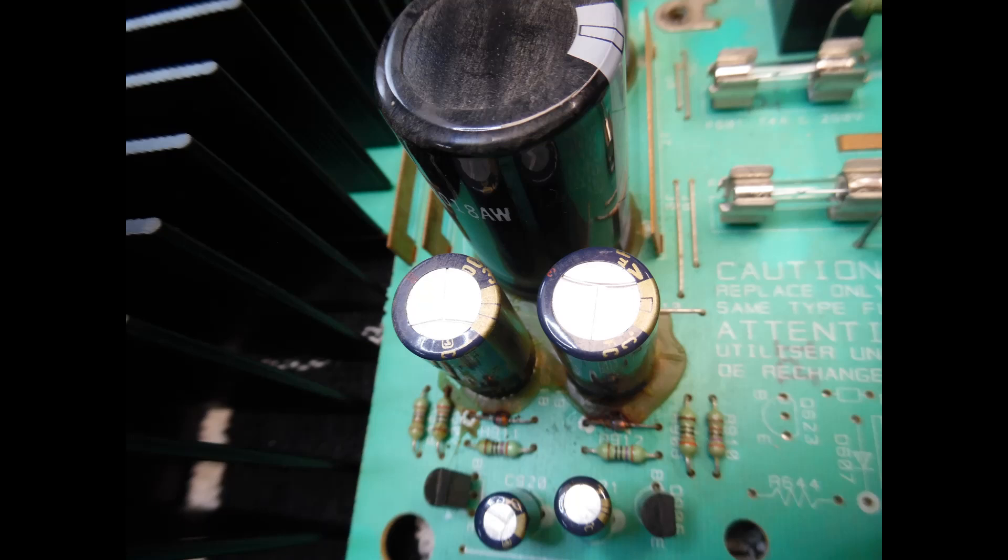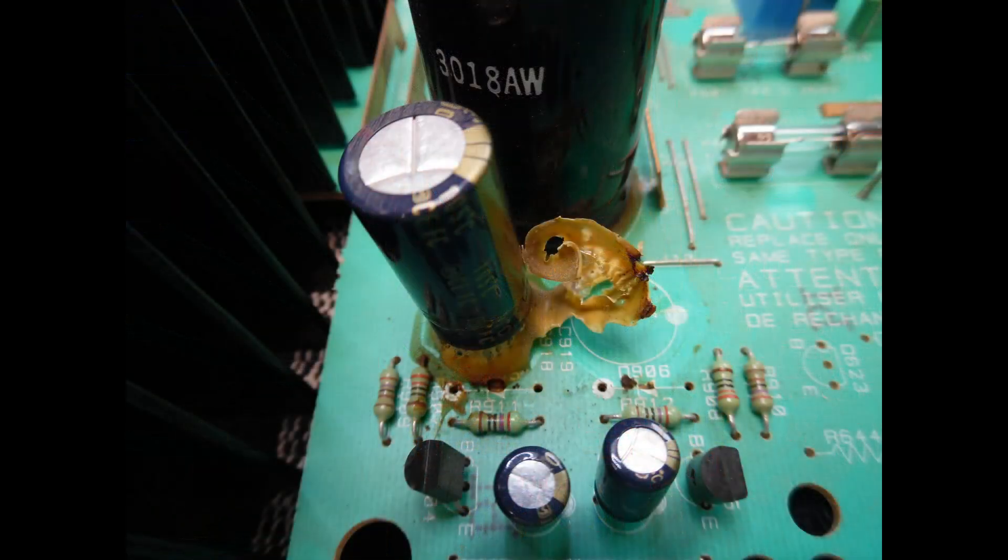The issue with this glue, described many many times, is that when first applied everything is fine, but as the amplifier and glue ages it does two things: first it starts to become conductive, and second it also becomes corrosive. What we're showing here is this glue around the capacitors, also coating the plus and minus 18-volt supply zener diodes, and literally when you touch these they're all breaking off — that's the level of corrosion. In the next image, I've removed one electrolytic capacitor and you can see the glue still has some elasticity; in some cases it can be completely dried out like a lacquer.